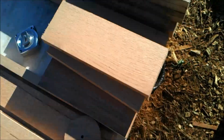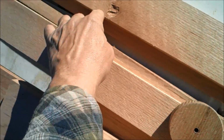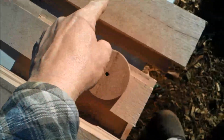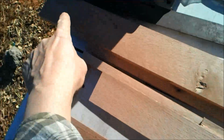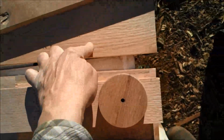And then we'll have to lay out this. This will be 2 lever arms. I've got to drill some holes down the middle here, as well as in here for screws. So where the dado is, we're going to screw it together, and we'll screw it together at the base. These boards, I have to mark, I have to drill, and then I have to rip it in half so that we have cute little notches to hang our weight on for the lever arm. And then we'll take out a portion here of the middle.